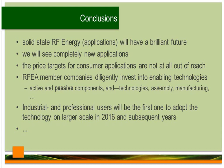There's also recently, as you're probably aware, MACOM has announced gallium nitride on silicon. They still need to get the manufacturing base in order to have a chance to meet LDMOS kind of price levels. If this is true, then there's definitely a proposition there. Other than that, I believe that for the low end, say the high-volume consumer type of market, I would think that LDMOS is currently still the more economical proposition.